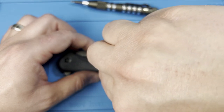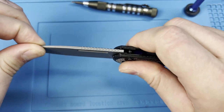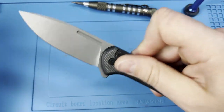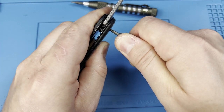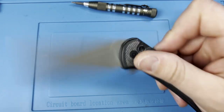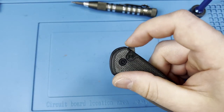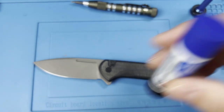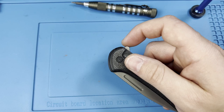Go back and check yourself — make sure everything's nice and tight on the back, check your centering one more time, and check your blade play. I might have a hint of wobble, so let's flip it a couple of times, which will also help the oil work in. If your pivot is backing out, you can remove just the pivot bolt with all the hardware installed — it'll keep the spring from pushing the scale out too much — and add a little Loctite. I recommend letting it sit at least 24 hours, ideally 48 hours. You just need to cover a little bit of the threads.